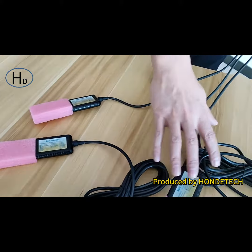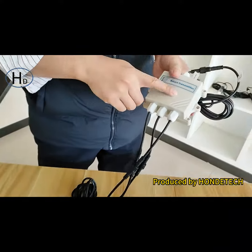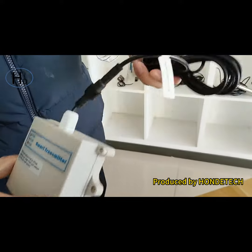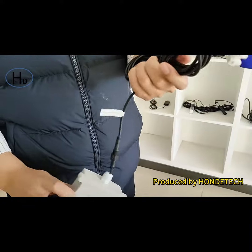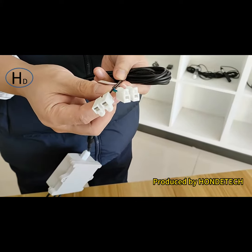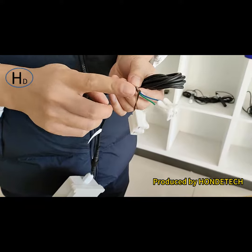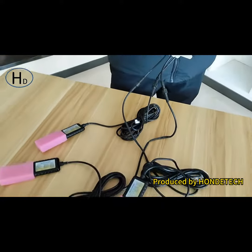We integrated these three sensors by this smart transmitter. This smart transmitter can integrate all three sensors into one. It is RS-485 output with standard Modbus protocol. You just send one instruction and then get the three sensor data at the same time.